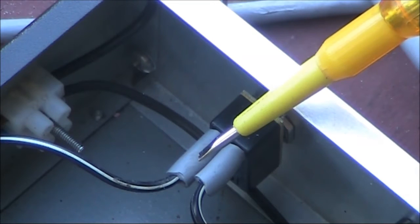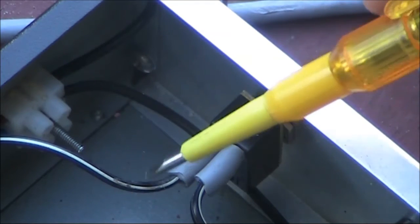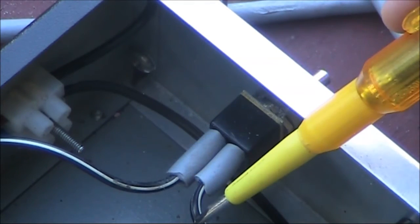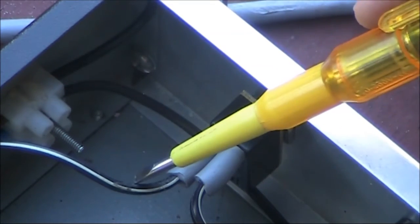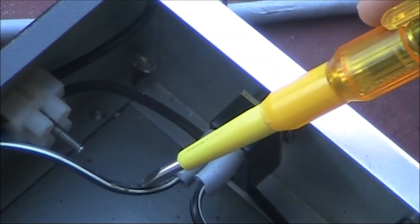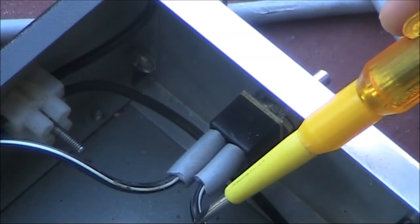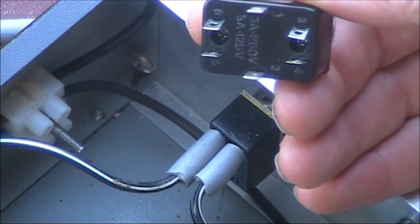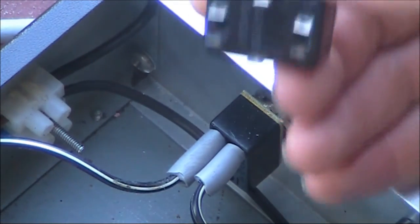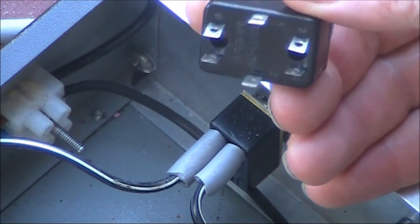Here's the on/off switch for the supply. It's on the primary — the 240 volt side — of both transformers, between the transformers, the fuse, and the power cable. Note there are only two wires going to it — that's a single pole single throw switch, wired in the active line. That's not ideal because there can be power points or extension cords where active and neutral are transposed. It's safer to switch both active and neutral, which you can do by wiring a double pole double throw switch instead.